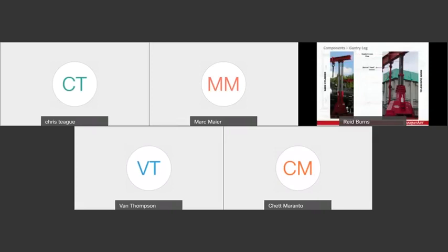Some units, not all units, but some units have what's called a manual or a dead section. Oftentimes, this is not a hydraulically powered unit. If you were to cut it in half, you would not cut through a hydraulic cylinder, but it can be lifted with the hydraulic cylinder, pinned off to your first stage, and then your cylinder retracts and pins back into your first stage. So a little confusing there, I understand, but the main thing to remember is that dead section, if you were to cut it right through the middle, you wouldn't have a cylinder there. It's just a fixed piece that's pinned to the top of your first stage. And that's only in boom style. You don't see that in the exposed bare cylinder models.